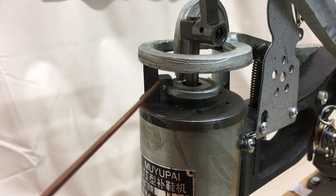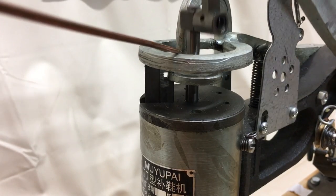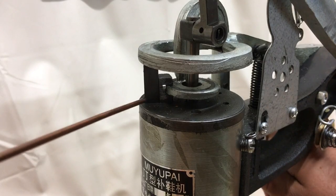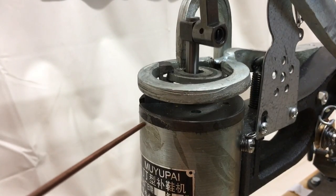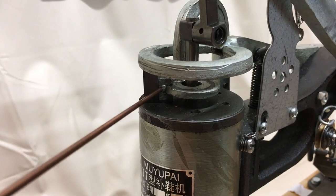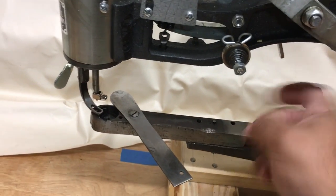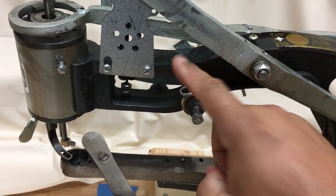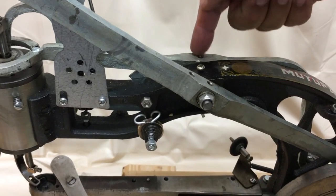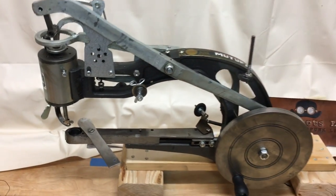Right into this area and one along this bar, between these two pieces of metal — this is the one that as the needle goes through, the foot comes up and down. Right now it's in the up position so it's not applying pressure, but once it's in the down position it will move up and down. To prevent a lot of friction, put oil right between these two — it's a hard spot to see. The lever for moving the foot up and down is in the back; pressing it toward the needle pushes the foot up. It's a little bar that goes in the back and lifts this one up by pressing toward the left.